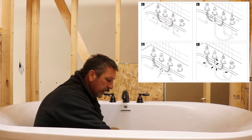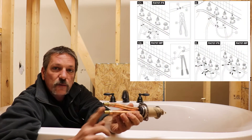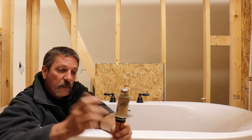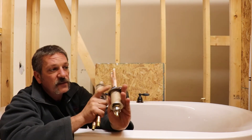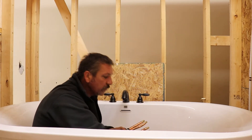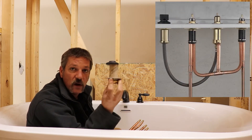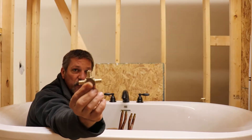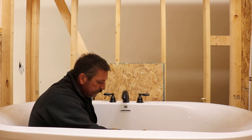The new style we use looks like this. It's already PEX-ready with fittings on the bottom. This one is the cold water valve — there'll be a white sticker indicating the hot side. That straight piece is your incoming and the other piece is your outgoing. It has a port for the spout, and some have a side sprayer attachment. This PEX-ready version comes with a brass PEX 90, so you do your connection in PEX rather than sweating a brass fitting like the old style.